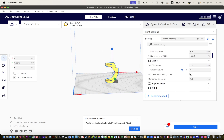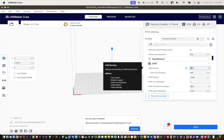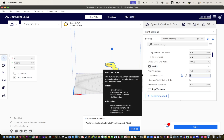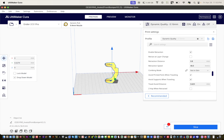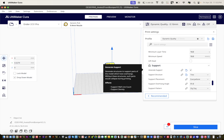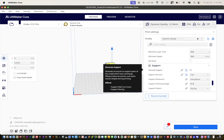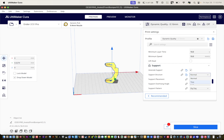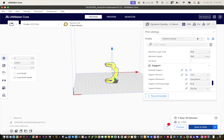We'll go to Walls, which are set to six, and Infill is at 25%. The walls are right here — change that to six. Now scroll down and look for Supports. You'll see Skirt and three. Click Support, a new menu will appear — select Tree supports. Normally it defaults to Normal, but I'm going to Tree. Leave the placement set to Everywhere and then we'll slice it.